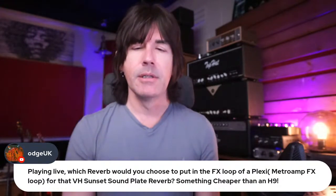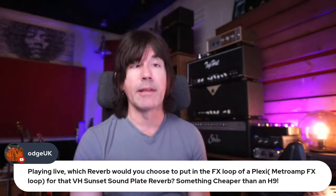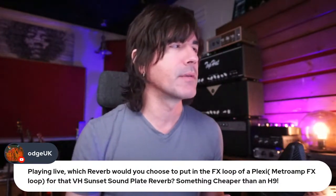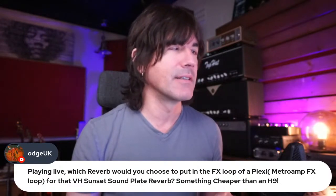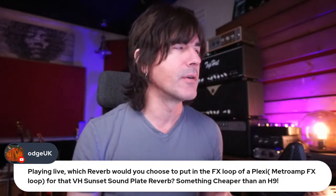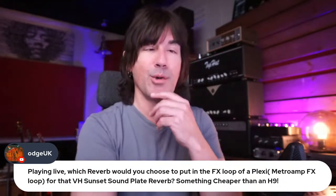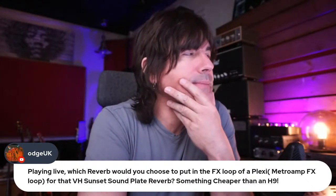But I hesitate to tell you that it'll work great in the loop of that amp when you're running the amp like you will, which is everything all the way up. It's probably going to sound a little crazy, because it's going to distort a little bit going into the phase inverter. Rather, the phase inverter is distorted, so the reverb will become distorted. Yeah, that's the only thing.